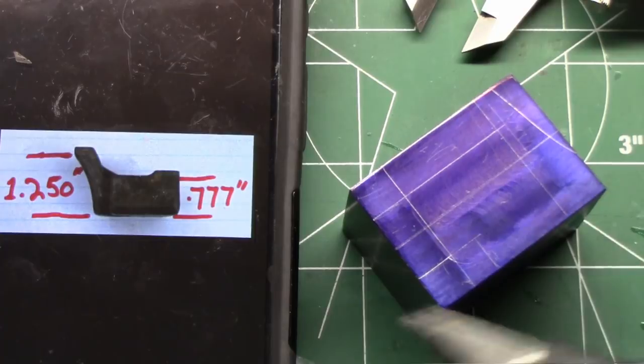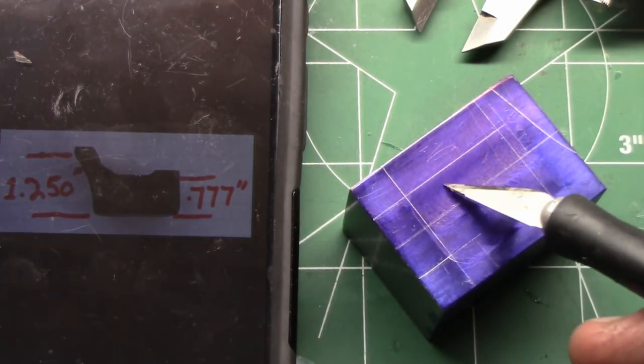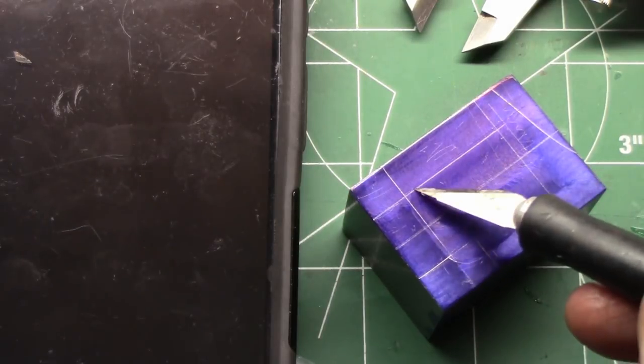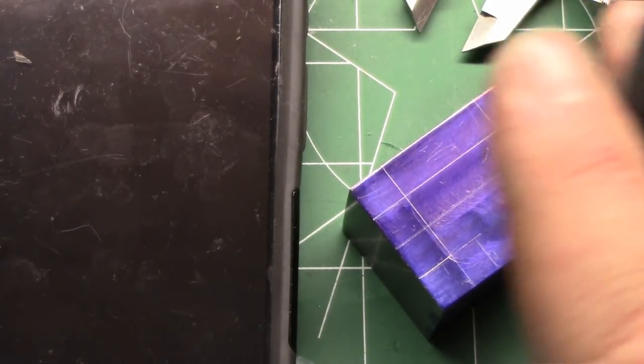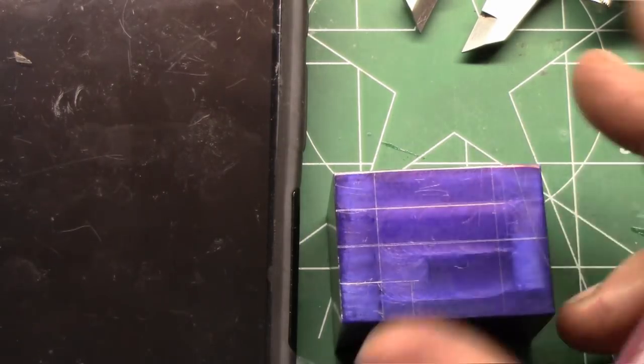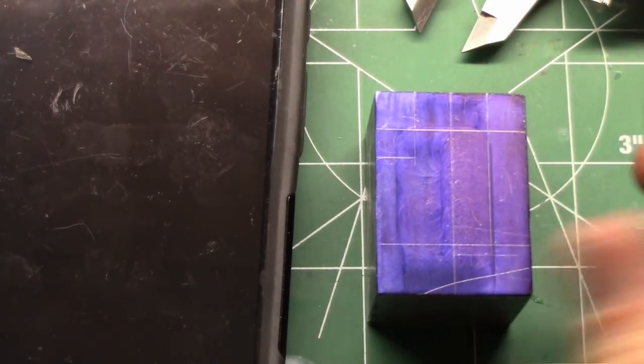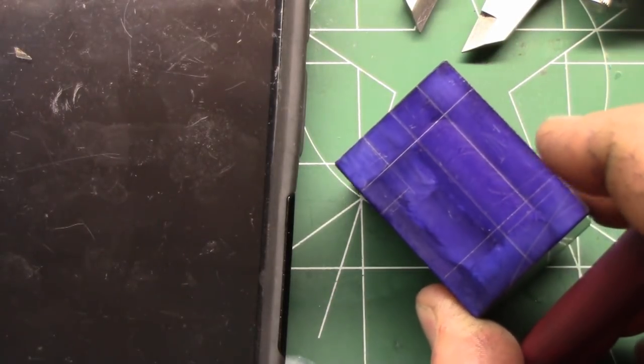It's not too tough. It's just a matter of figuring out the measurements. And we're going to be doing lengths and stuff by calibrated eyeball. We're just using these scribe lines. More than adequate enough. It doesn't really need to be supremely crazy accurate. It's just a bed clamp. So milling to these lines will be perfectly acceptable.